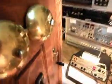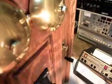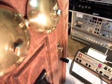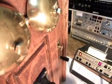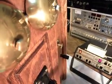Give you some dial tone. Basically, without the proper wiring and a switch in line to take you away from the telephone line, when you crank the telephone, which makes the bells ring, it would shoot a back voltage into the telephone line and ring all the phones in your house. It would actually ring them. So you would be pumping a back voltage into the line, and that's probably not a real good idea. I don't think it would hurt anything, but like I said, it's probably not a good idea.